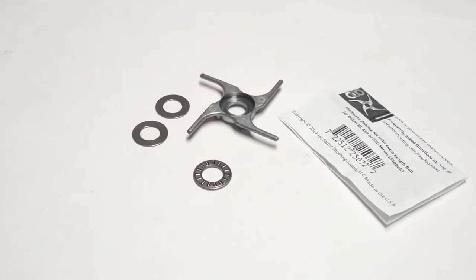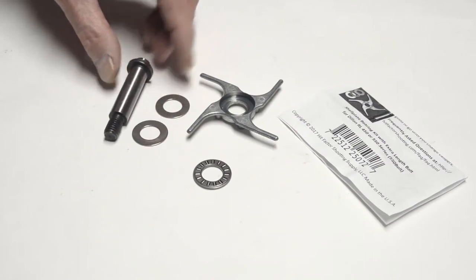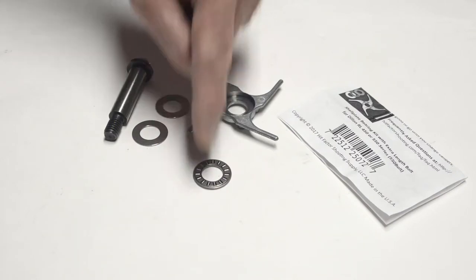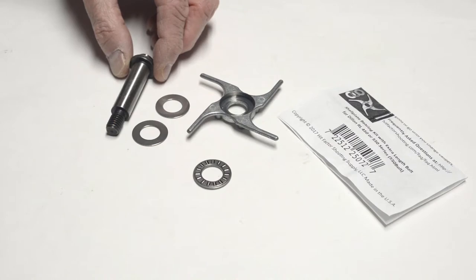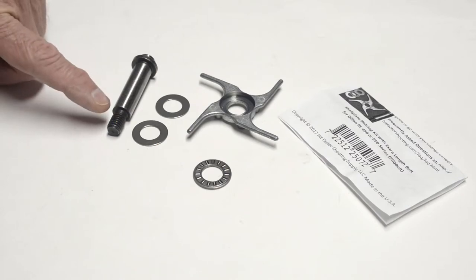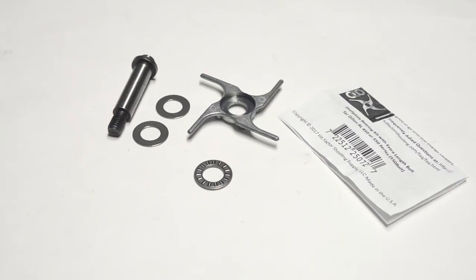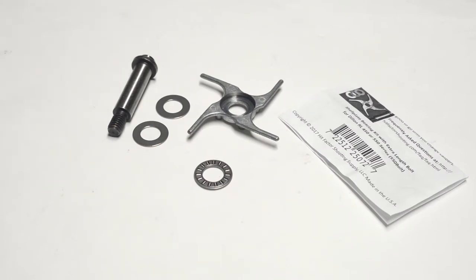But the biggest thing is it comes with an extended shell plate bolt. If you remember in the original video, once I had installed this, the shell plate bolt raised up some. And when inserting the set screw in the main shaft, the set screw was trying to make contact down in that area, which it could not — leading to issues when trying to reload.